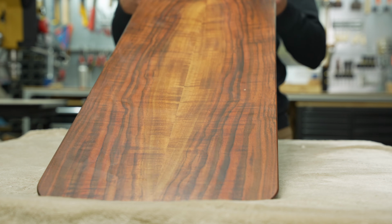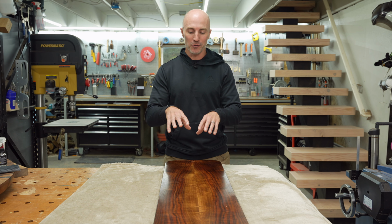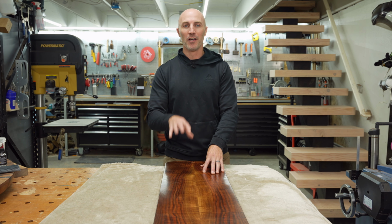But for you, if you're used to traditional wood finishes, this isn't a wood finish. This is just a nano coating to go over your wood finish. And you only have anywhere from 30 seconds to 90 seconds to buff it off. So if you're used to a traditional wood finish and you're gonna come back in 10 minutes, you will have problems. So if you do have those problems, if you get that streaky finish, this is the video on how to fix it.